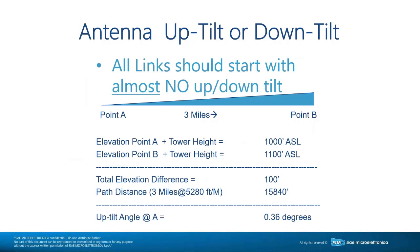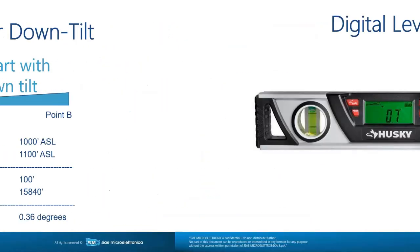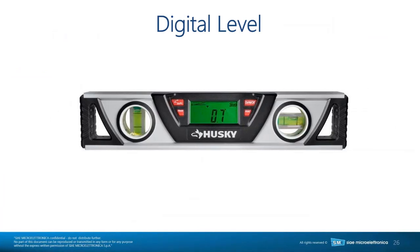The next question on antenna alignment is: does my antenna point up or down? The reality is that most links are relatively flat. For example, a three-mile link with a 100-foot elevation difference between the two ends — which sounds large — comes down to only 0.36 degrees. So take a digital level with you, put it on the back of the radio, which is perpendicular to the direction of transmission, and set it to 0 as your starting point.